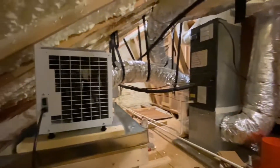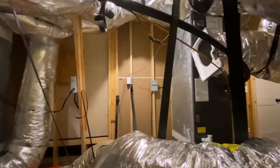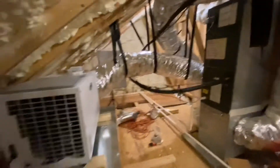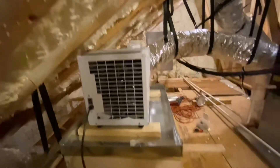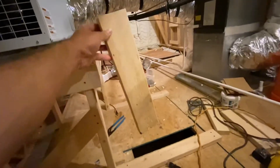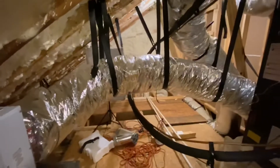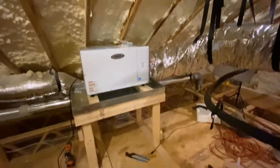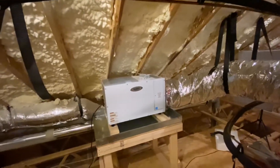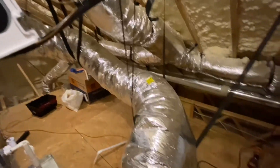I've got the dehumidifier moved. It was sitting right there between the two HVAC units, and now we're over here, right up against the ceiling. I had to cut 16 inches off these legs. I've already got the return hooked up over here — looking pretty good. I got to run to the store to get some stuff for the condensate line. And then we'll have to cut this — this supply duct is going to be way too long, we're going to cut it off.